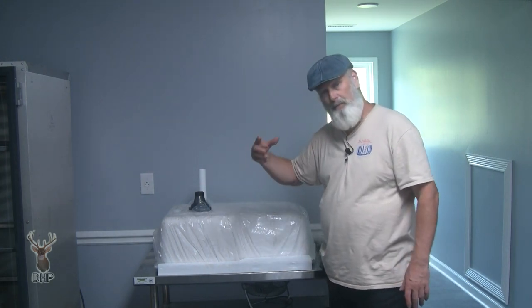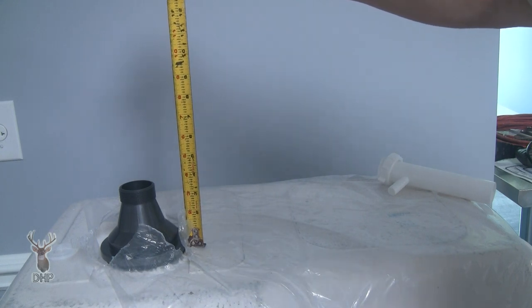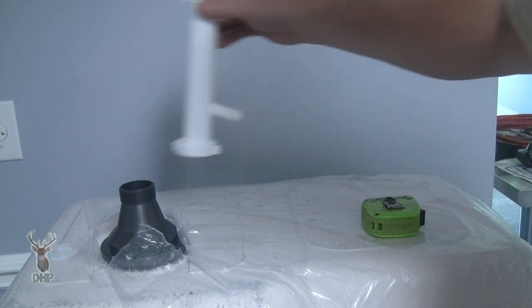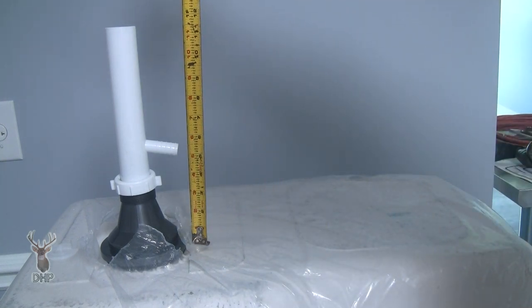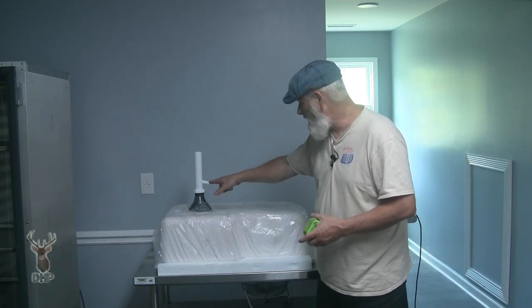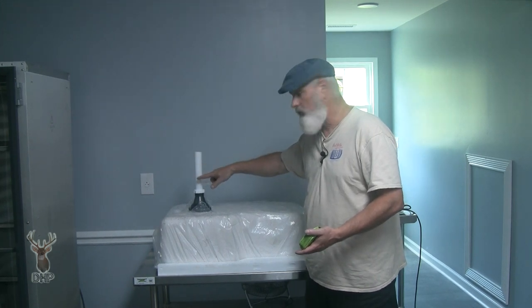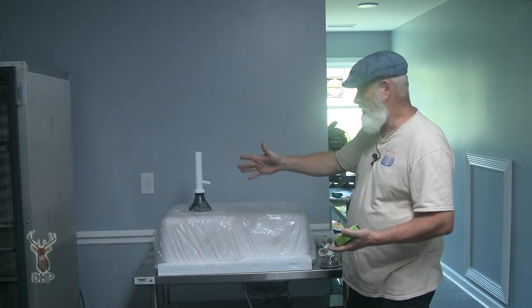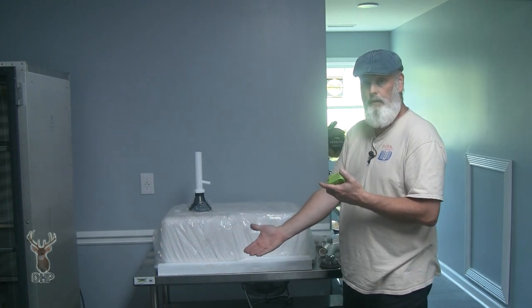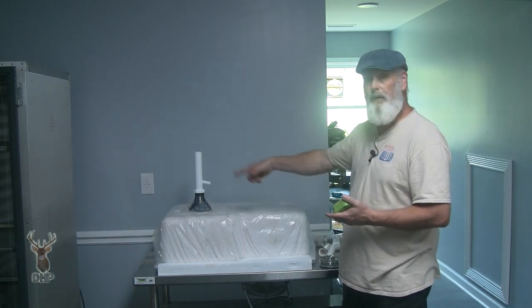This is an even greater challenge. This connection here is just a little shy of four inches, so now I'm at least 14 inches before I can even get to this surface. And because I have a dishwasher, that tailpiece goes down another two or so inches that I can't adjust. So I'm automatically stuck with two more inches. The next slip fitting needs room for the top part to connect, which puts my height way down toward the bottom of the cabinet. The sink will drain as long as the wall entry is lower than this point, but I still need to fit a trap and other connections in there.